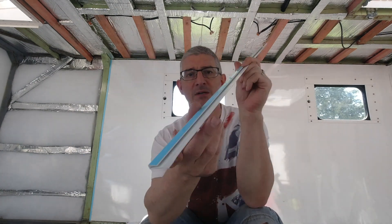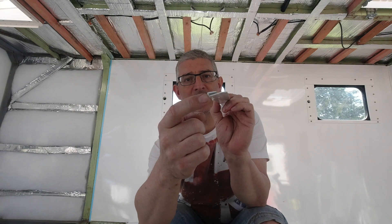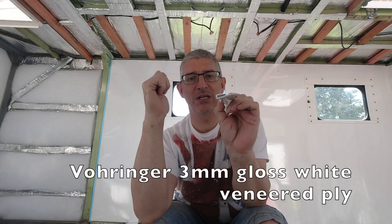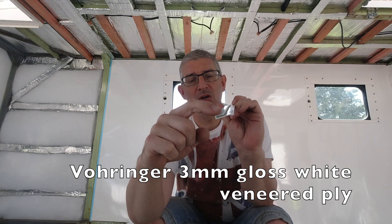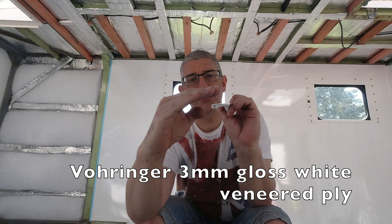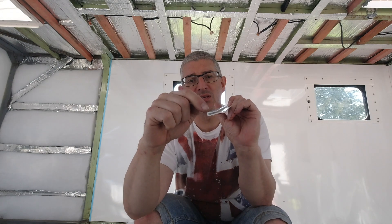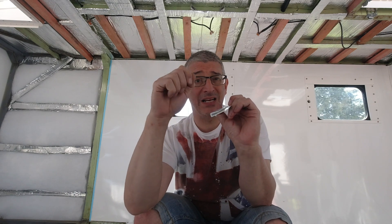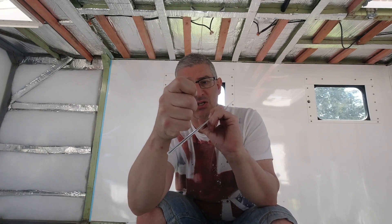And the one at the edge — I took this measurement to be the same or a little bit more than the ply coated sheeting, but as you can see it comes in like that, so it's a devil's own job to get it in. What I ended up doing was gently heating it with a heat gun, allowing it to soften and open out a bit so I could put the board in. The other technique was to use a really clean, broad scraper to slide it up and help get the board in, then start at one end and use a soft rubber mallet to knock the back — that won't damage it whilst you're knocking it in.